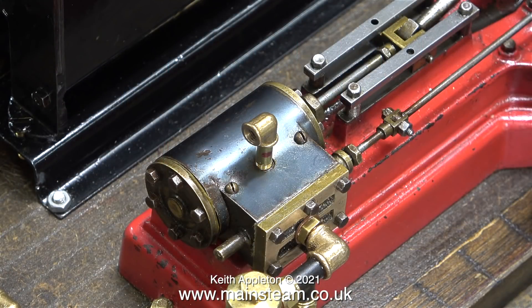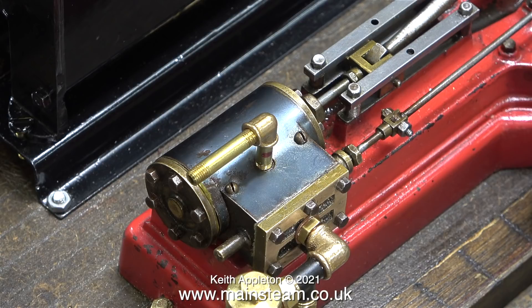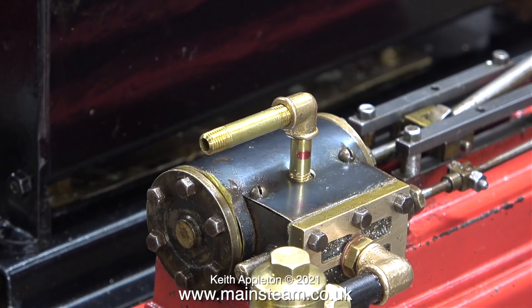This clip shows the cylinder block and the 1/4 by 40 union fitted to the steam chest — really this size is a bit over scale. It's fine for holding the displacement lubricator, but I don't want to use 1/4 by 40 threads per inch for the exhaust piping. You can clearly see the physical difference in size between the one on the steam chest and the exhaust pipe sticking out of the top of the cylinder. It's all a matter of scale — the displacement lubricator is massively over scale and is a functional device, not part of the appearance, but the exhaust piping can be much closer to scale.